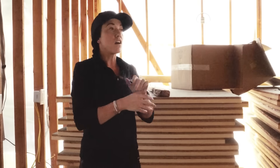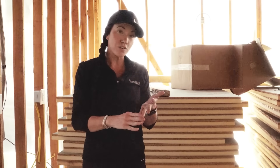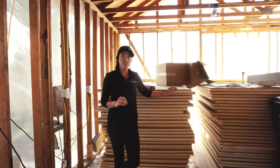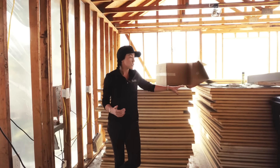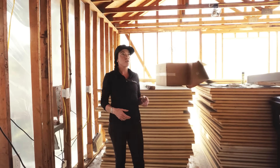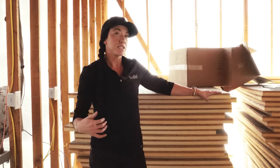This is going to give us that continuous barrier around the outside of the home. There are a few things to think about when ordering new front doors, exterior doors, and windows — this product is way thicker than the original quarter-inch cardboard, and even compared to seven-sixteenths sheeting, it's still a half inch thicker. When we placed an order for a new front door, we had to order it with brick mold and a specific jamb depth to account for this added thickness and our new exterior material.